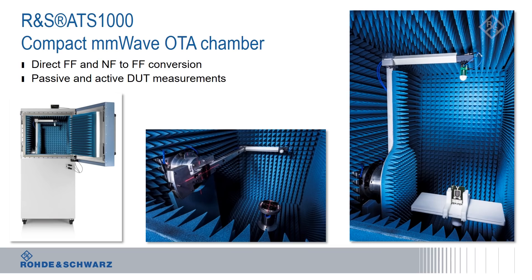Positioning these antennas to scan over a sphere around your DUT, you really need to make sure you are doing very careful positioning. Otherwise, if you deviate from the position you think and fit this into your near-field to far-field algorithm, deviations will pile up and create large errors. In the ATS-1000 that you are seeing, we have positioners that enable better than 0.1 degree accuracy in positioning.